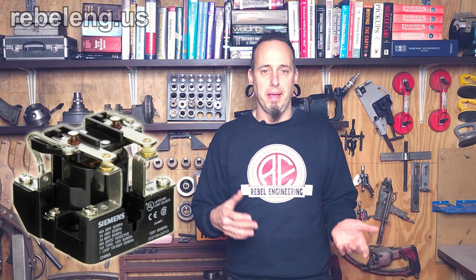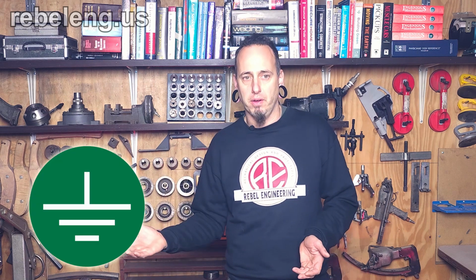This wastes power by maintaining the pilot arc back to a ground instead of cutting the metal. This could also damage your machine. If you already have a high frequency machine that needs a pilot arc, this is an option. But if you're buying a new machine, you will spend more money on the proper electronics to make this work than you would spend just trying to purchase this feature already incorporated.